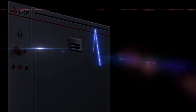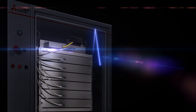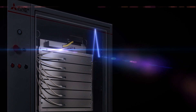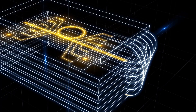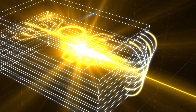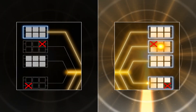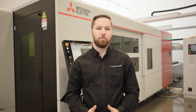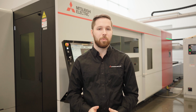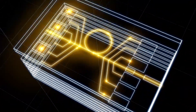To extend the lifetime of the modules inside the oscillator, we've addressed the way individual diodes are wired in each module. Each diode in the module is wired in parallel, which means if we were to lose one diode in a module, the rest of the diodes in that module would remain unaffected. So instead of losing the entire chain, we just lose a single diode. This equates to a lower load placed upon the other modules in the system in the event one diode were to fail. Ultimately, this allows us to run the machine without the risk of damaging other modules in the system.